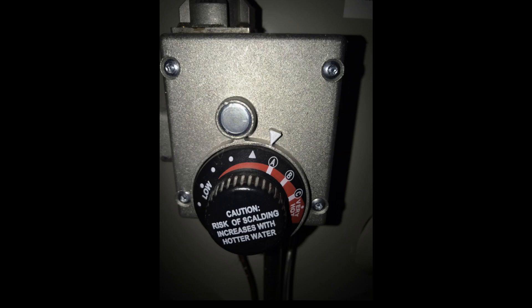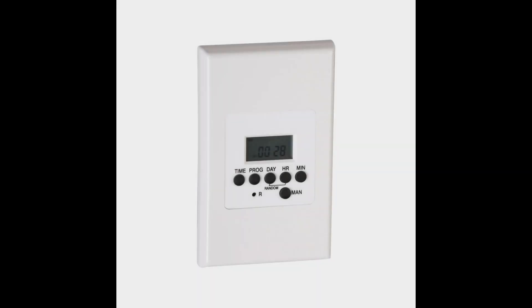I don't care about the extra power because it feels way better. For conserving power, I've also got a timer on my hot water cylinder so it only runs for a few hours a day when there's plenty of sunlight — so it's free. The water in the cylinder easily lasts 20 hours and is still hot the next morning. So if you're going to get a plumber out, also get them to install a timer because it will save you a lot of money. Without the timer it was constantly kicking in and turning off, especially in winter when it's cold — that's just a waste of power.